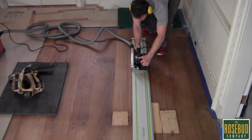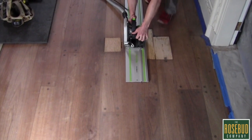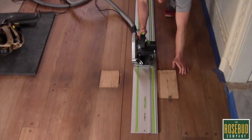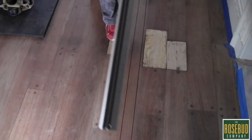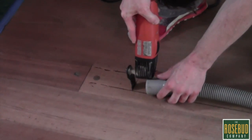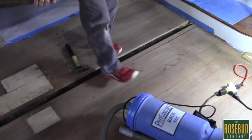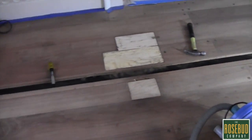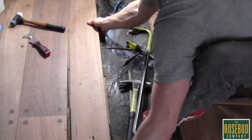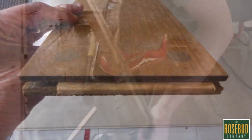Peter starts the repair work by taking one piece that we consider to be expendable and making multiple cuts to create an area to work. Here he is on his second cut, and after he got through with this you can see that number one there's no dust, no debris, because he's using a good vacuum system on the saw. Then he square cuts the ends with a fine saw, making sure to collect the dust, and this creates a very nice work area. We remove the piece that was considered expendable and now we've got our workspace, which allows us to come in from the side and start extracting the wood. The splines and the grooves were nailed down with finished nails, which allowed for a really nice clean extraction.